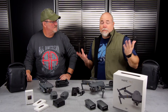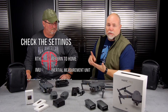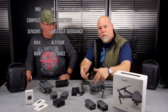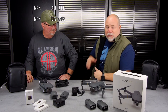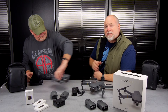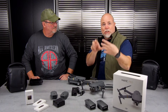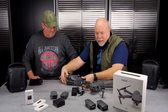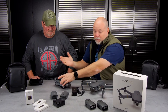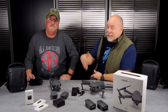With any firmware update, after you're done, make sure to go through all of the main settings — your return to home altitude, obstacle avoidance, max altitude and distance, and also do an IMU calibration. On the P4 Pro and the Mavic it's a little different. You don't just set it on a table and leave it; you actually have to set it on all four sides. The app shows you a picture and tells you to set it on the top, then the side, and a little green dot goes across to show it's done — almost all six sides.